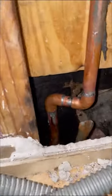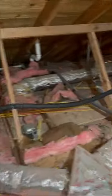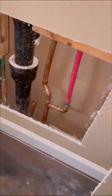We do not break through the foundation to fix these leaks. Instead, we capped the feed line and rerouted overhead through the attic. Thankfully, this home already had a hot water line in the attic from a previous reroute, so that made this reroute easy to do. This was an older home and the entire system was half-inch piping, which is why I used a half-inch line for this reroute.